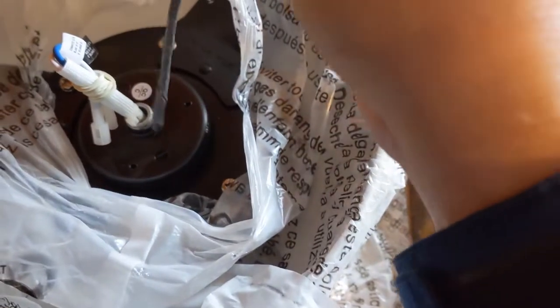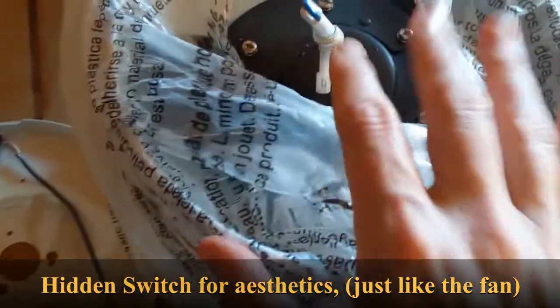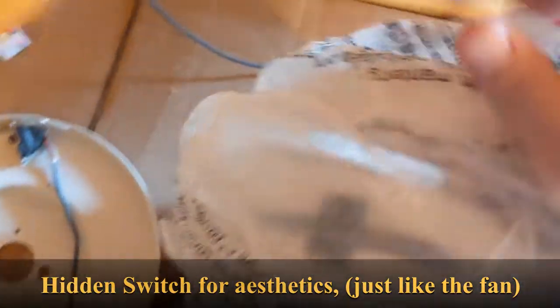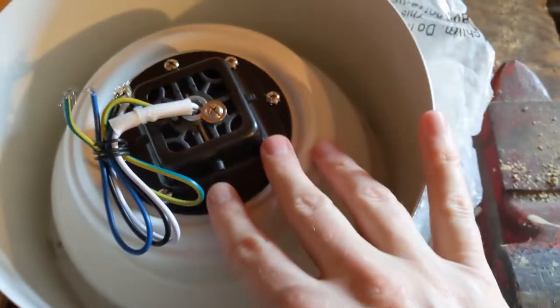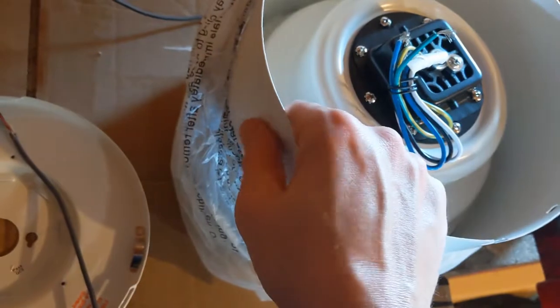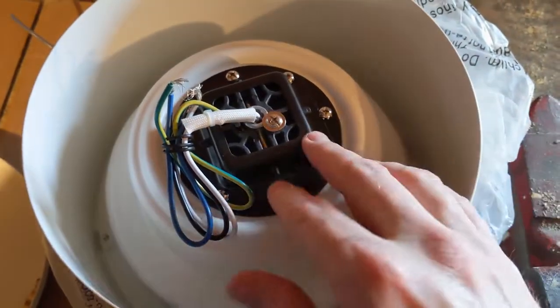I'm going to install it right here. It's going to go down to this - this is the bottom. This is the particular model; usually these are on the side of the chain pulls and those are a lot easier to get to. The other alternative is I have to get in here - here's where the controller is where I'm going to wire into. Another thing is you could run it up through to the side, which is a lot of them are visible, but on this one we're going to keep it hidden.